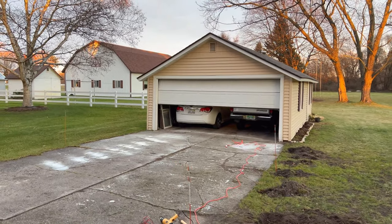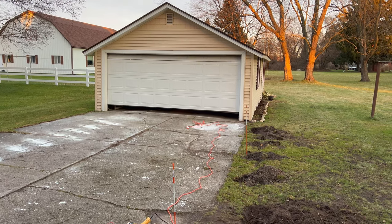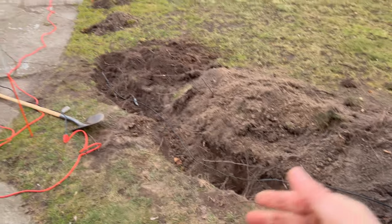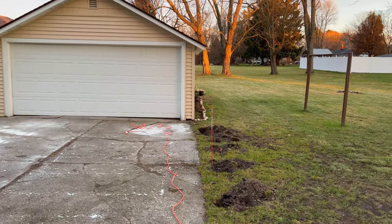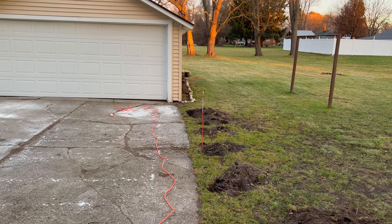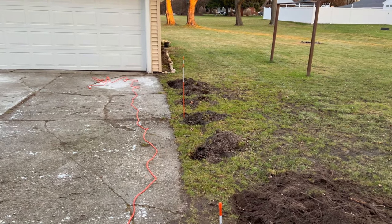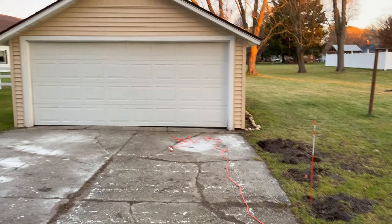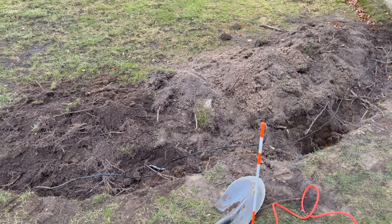Oh yeah, there we go, everyone. There we go. That was it. Unfortunately, though, I only got continuity on the green and yellow wire one. So there's still something wrong somewhere yet. Either my repair isn't good, or there's something else wrong somewhere along the wire. I suspect something else is wrong along the wire, because the other pairs have continuity, but very, very poor, even though nothing's connected. So that tells me there's probably a break in the wire. Something's corroded out somewhere. Don't know where. But anyway, green and yellow, it's working. It closes the door. So I'm going to get this tidied up here a minute, and we'll go from there.